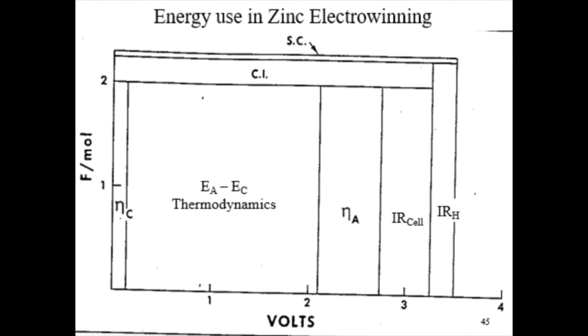We can combine all of our measured data into what's called an energy diagram. This diagram shows the total energy consumption as a sum of the individual components. We can also calculate some key parameters, such as the specific energy consumption — which is kilowatt hours of energy consumed per kilogram of metal — and the current efficiency, which is the experimental mass produced as a function of the theoretical maximum. Perhaps you'd like to give it a go for the values that we've used in this video.